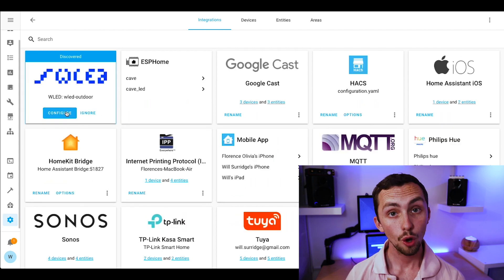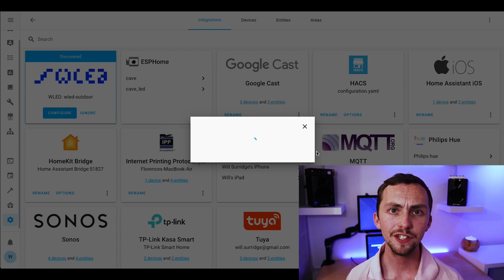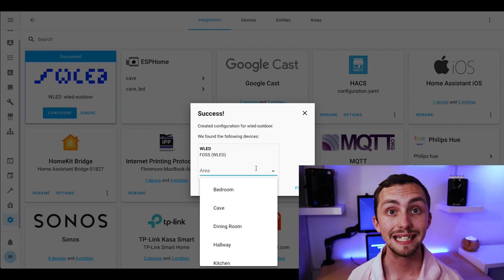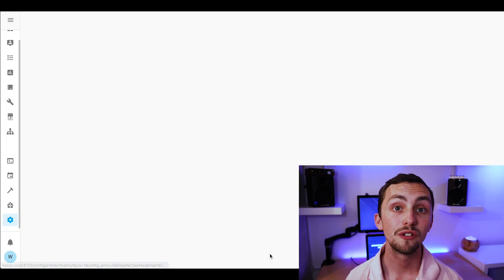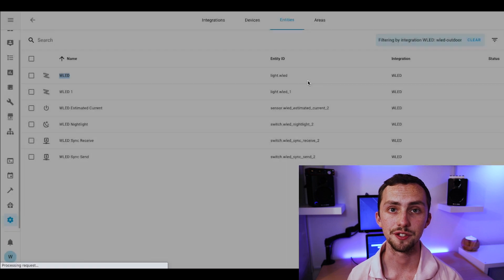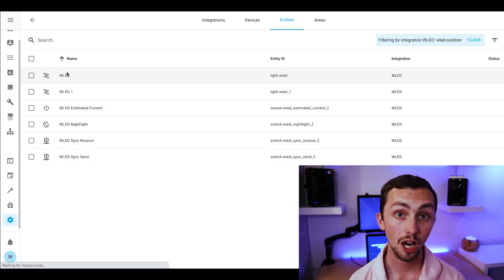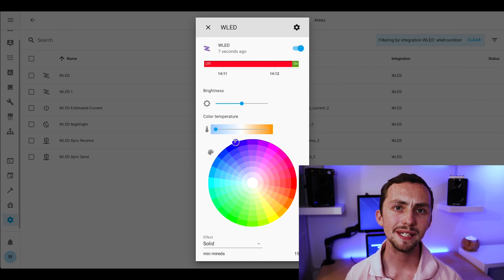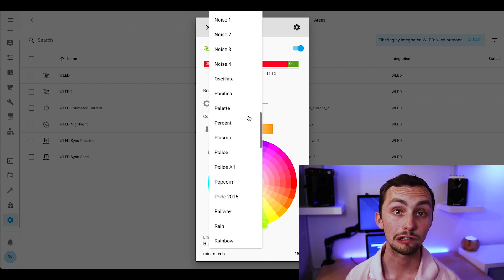Now let's integrate into Home Assistant. There's a built-in integration for WLED, so if you go into your integrations it should automatically appear. If it doesn't, click the plus, search for WLED, and type in the host IP address. If you're planning on using segments, make sure you set up your segments before you integrate into Home Assistant to ensure they show up properly. Once done, rename the device and entities so it doesn't get confusing. The built-in interface is quite limited — you can change the color, brightness and apply effects, but that's about it. If you integrate using MQTT you'll have much more options including effect intensity and speed. I've linked to Dr. Z's GitHub below where he's integrated all the features through MQTT for his WLED setup.